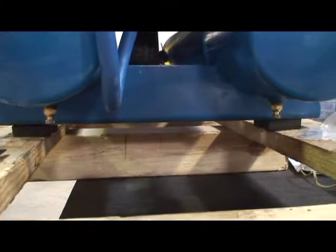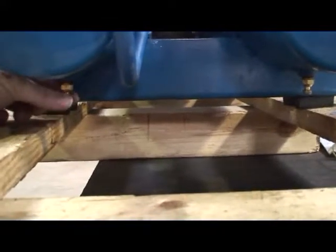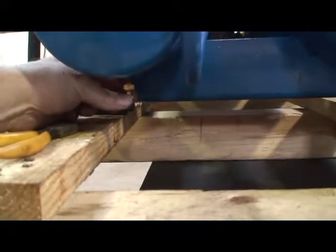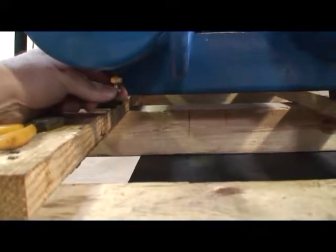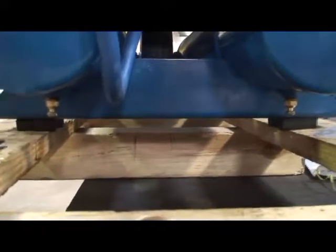This air compressor is equipped with standard manual drains. They're just quick seat, what we call a quick seat. There's a little O-ring in there. Should just be able to twist with your fingers to open that drain and then twist back to seat it. Doesn't have to be too terribly tight. Both of these manual drains on this machine should last for a long time.